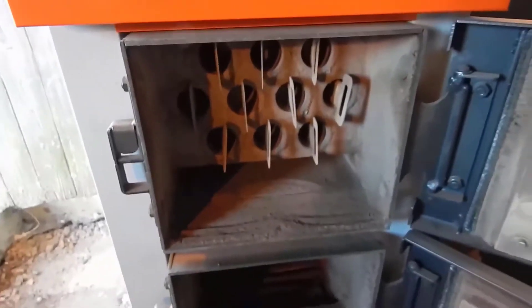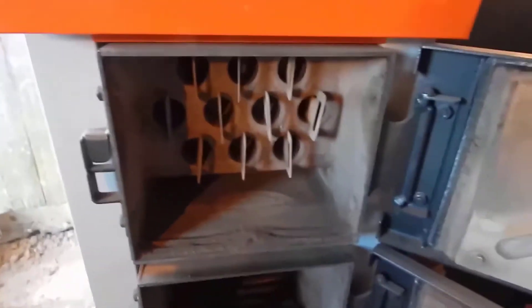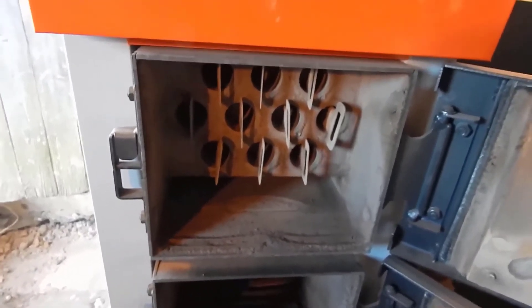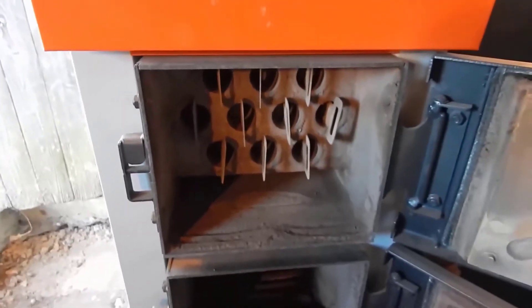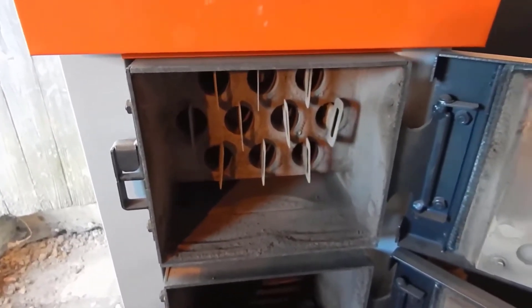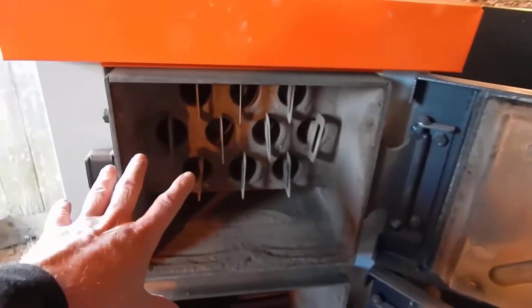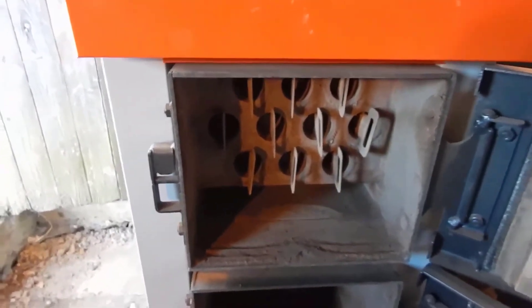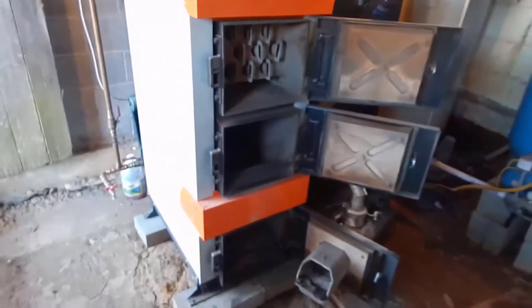I've been running a couple of weeks with a thousand pounds of pellets burned through it and it's still fine. I think I've actually run over a ton of pellets through it without cleaning. The more you clean it, the more efficiently it burns, because you get better heat transfer in the top chamber — less buildup means more heat transmitted through the metal into your water. Cleaning increases efficiency, but I haven't seen any need to clean it very often myself — it seems to burn just fine.